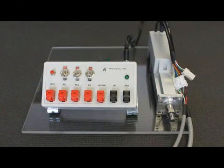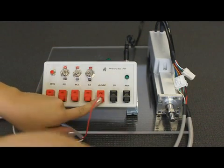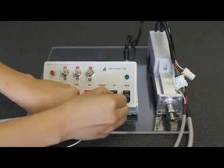We will now connect some of the inputs and outputs for the servo controller. These connections will be sufficient to allow us to run four moves with basic functionality. Note that 24V power is not yet turned on, and we are using a PNP actuator in this example. First, connect the red and black wires from the power cable to the 24V and 0V.